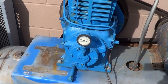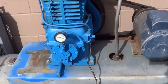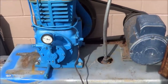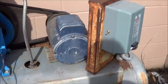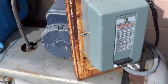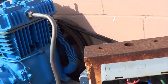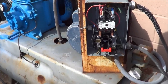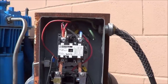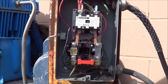The next question has been on wiring, and I've been a little reluctant to get into that because it is a dangerous thing. You've got to have a lot of respect for anything you can't see that can kill you dead. These 230-volt systems are probably a little bit more dangerous than 480-volt systems, for the simple fact that when they have a ground fault and the ground wire isn't connected, all it's going to do is energize the whole piece of equipment at 110 volts — because if you take 230 volts to ground, you get 110. So the ground wire is ultra-important. Don't ever run any piece of equipment without a ground wire, period.